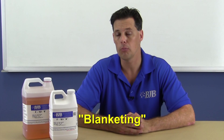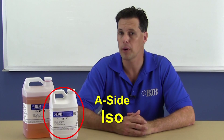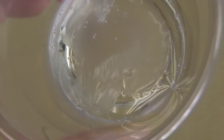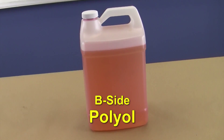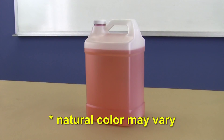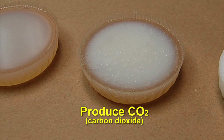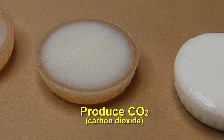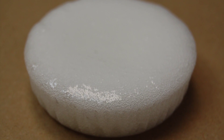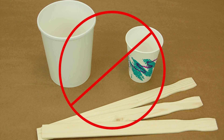This is what we call blanketing the material. To further explain how moisture affects polyurethane, the A side or iso side will visibly react with moisture — it can skin, get lumpy, or appear hazy and cloudy. The B side or polyol side does not show any visible effect, that is until you mix it with the A. At that point, the mixture can produce carbon dioxide and bubbles can form, in some bad cases even foam. Wood stir sticks and paper cups are a very common source of moisture contamination.